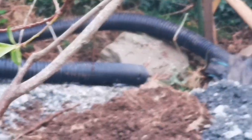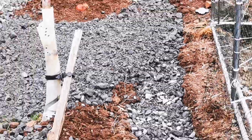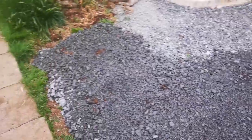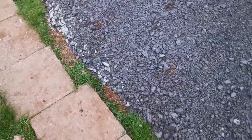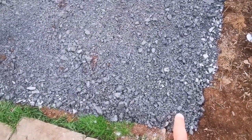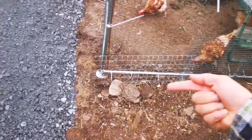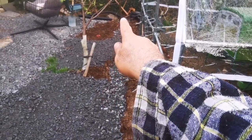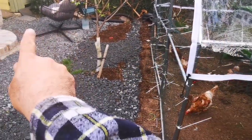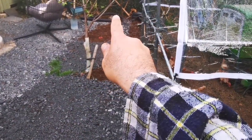At the moment it's done, for tonight when it rains, it will hopefully be working. The water which comes from this way gets into the French drain. All along, any water coming here will go to the French drain. Any water from this direction also comes and enters the French drain and flows that way. And if I direct it this way, any water coming from this direction and that direction will all end up in there.